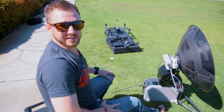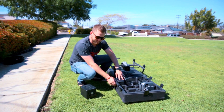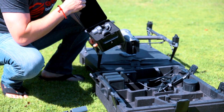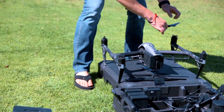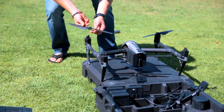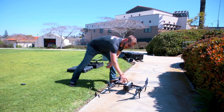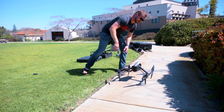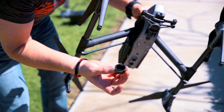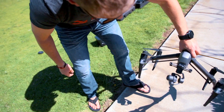While that's going on, I'm going to go ahead and set up my drone. We use all DJI products. You've got two sets of blades, an AC power cord, one set of batteries loaded and two backup — all of them paired — and your controller. The camera we include is the X4. First thing you're going to do is set your wings — the white ones go with the white ones; line them up, pinch and turn, and it snaps right in. Now we need to raise the base so we can attach the camera. Press the drone button five times. From this position, I detach the part that covers the camera gimbal by pressing the button and turning at the same time, then take off the cap. Line them up — one-hand operation here — twist and turn. Now the camera's attached.